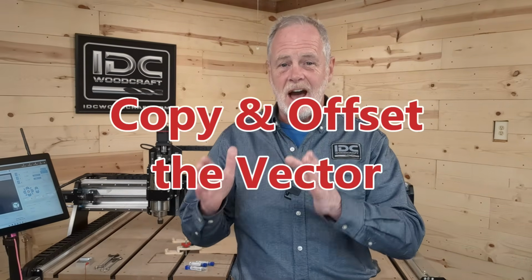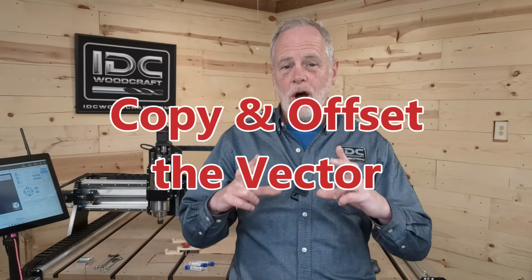Let's talk about the second technique that you can use to offset your roughing tools in your carve while you're designing your project. Technique number 2, create a copy of the original vector and offset it. When you're designing your CNC project, you are creating your finished cut lines. What you'll do is take the line of interest that you want to cut around with the roughing bit and copy it, but offset it by the amount that you want that roughing bit to be offset by. Let me show you how that works.